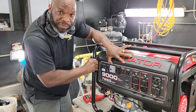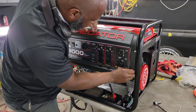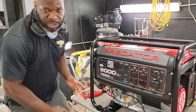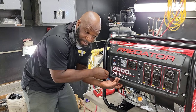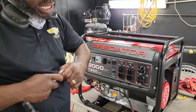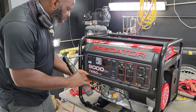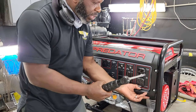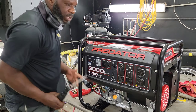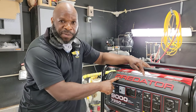When it was cutting off, it was aggravating. We've been in the middle of work and boom, the sucker cut right off. It wouldn't cut back on — that light would keep flashing. But that's how you bypass it. Again, it is a safety mechanism — don't do it if you don't have to. I don't recommend doing it. I'm doing it for my use of this generator, but I don't recommend it if it's around your home. It is a safety mechanism, it's there for a purpose, but it is very sensitive. So just reinstall your four eight millimeter bolts, put your board back up. And folks, that is pretty much how you bypass the carbon monoxide sensor on the 9000 Predator from Harbor Freight.